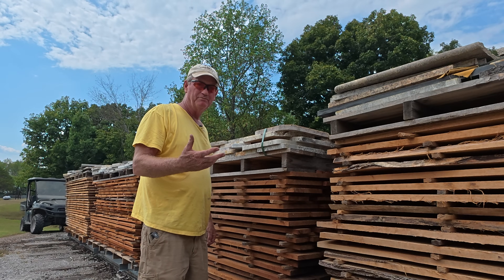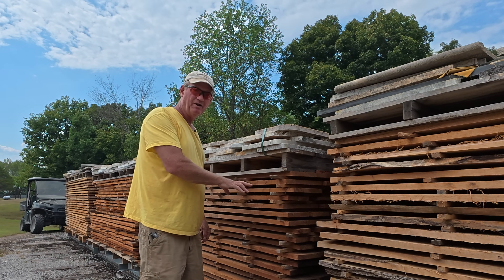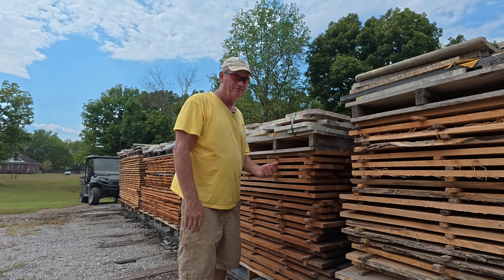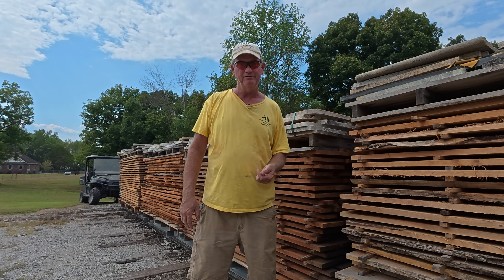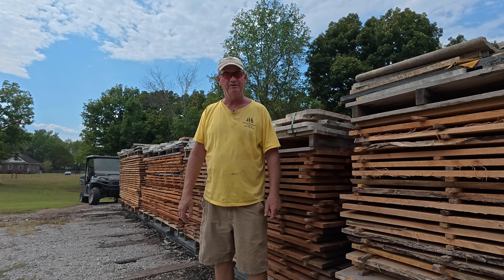You've got to dry it all out. You can't sell a board that's 7% moisture on one end but has a 14% moisture wet pocket in it — that board's not going to be straight. The board has to be dry throughout. It may take an extra two or three days in the kiln to get to that point. Since you're doing direct measurement, the load may also dry out faster than expected — take it out and save a day's worth of energy.